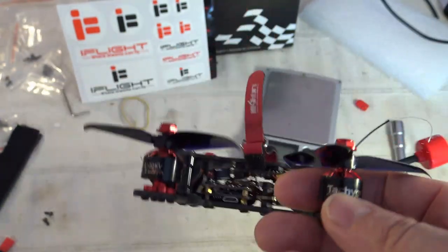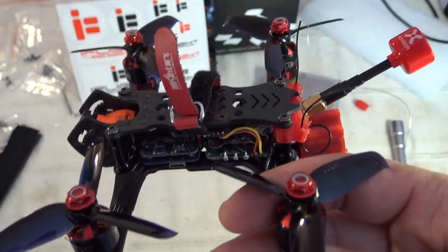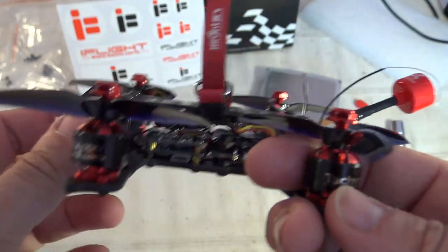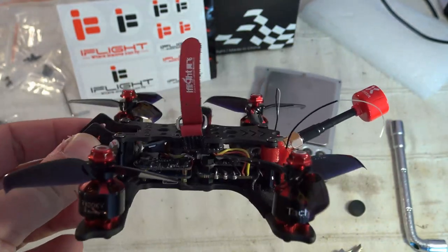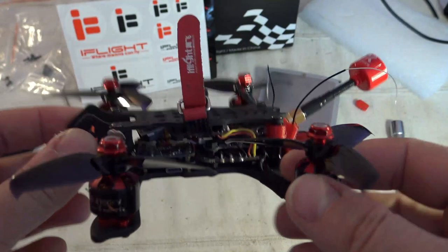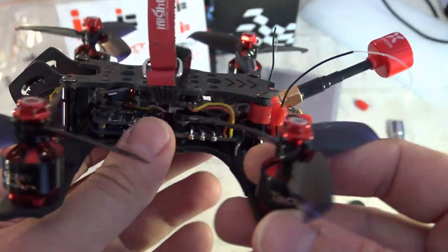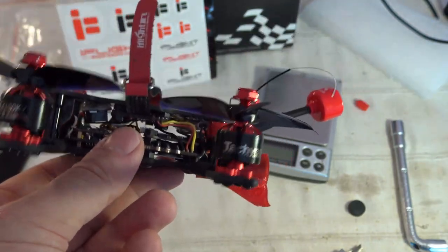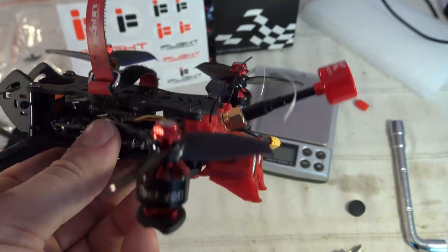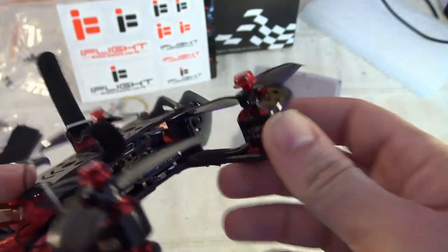That's a drawback. This F4 board is limited in terms of available UART ports, despite the fact that the F4 board should in theory support more than 4 UARTs. Here in this case, there are 2 physical ones. What I also don't like is that everything is soldered, no connector to make your life easier, for example for updates. So it means that the camera needs to be triggered manually thanks to these two buttons.